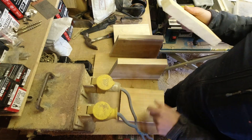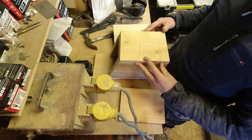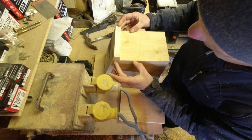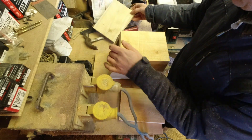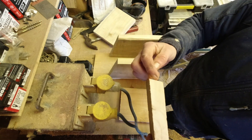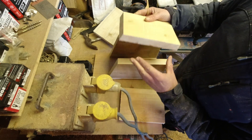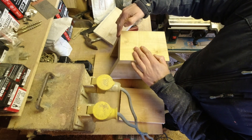I was just doing a quick dry fit. What I did notice when you put the front on is: if you don't chamfer it at the same angle as the sides, you end up with the roof sticking proud at the top. So I've cut that angle at 19 degrees to match the sides. If you didn't want the chamfer, you could cut the front piece about eight millimeters shorter — because of the inch thickness of timber, that will give you enough clearance for the roof.